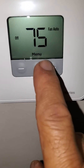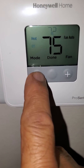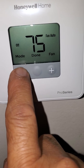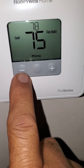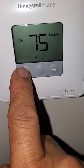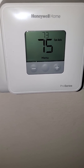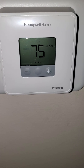Right here where it says menu. The mode — heat, cool — and we're going to lower the temperature. We put it back heat, cool, done. Now you can lower the temperature here. The unit is going to come on in a minute — we're going to put it on 73 and see what happens. When it's flashing like that, it's going to take a five-minute time delay.